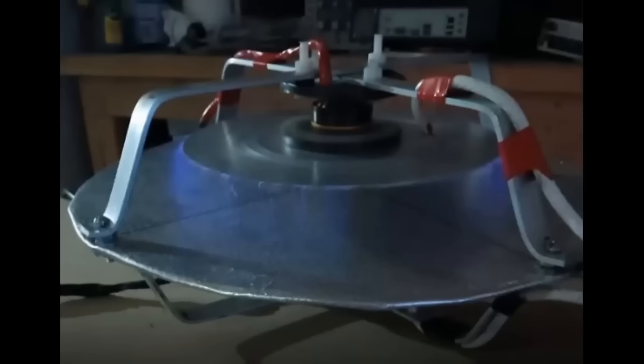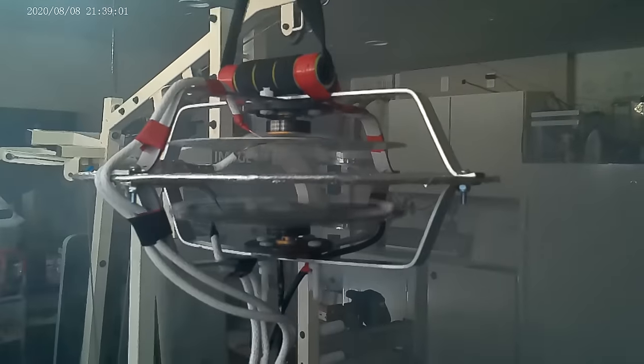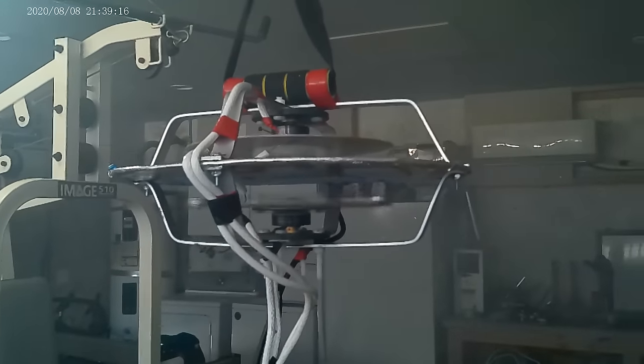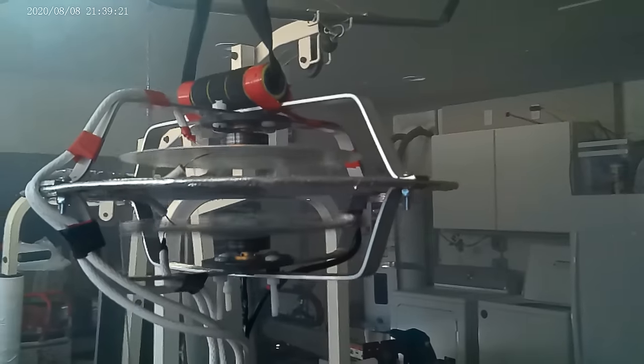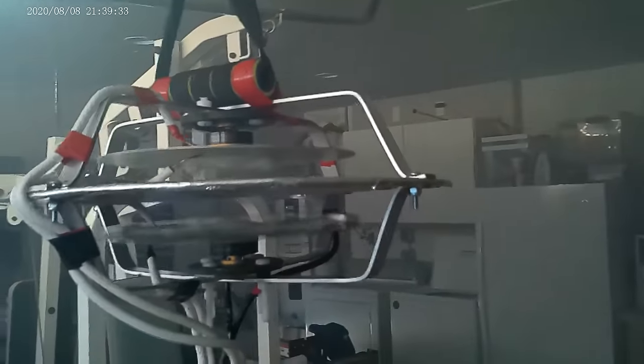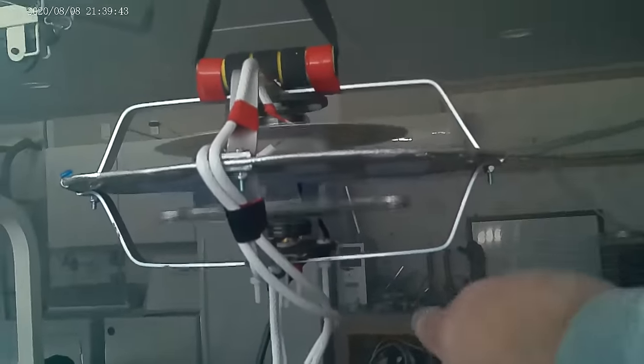To fix the sparking-over problem I just moved the upper plate a little bit higher. The next logical question was: if it doesn't lift on ion wind, does it lift by the rotational force of the disc — can we create enough wind to make it lift? So I put a fog machine to it to find out. As the fog comes in you can see it has absolutely zero effect on the wind — no wind push between the center plate and the bottom, nor between the top plate and the center plate. This thing could sit on a still night and you'd never know it's there.